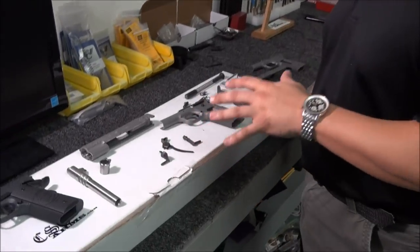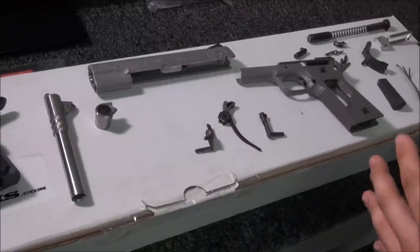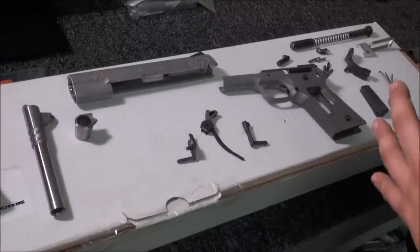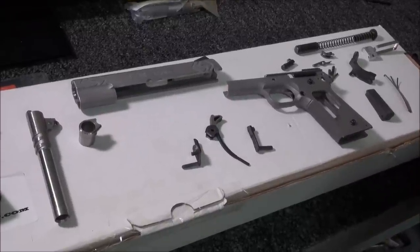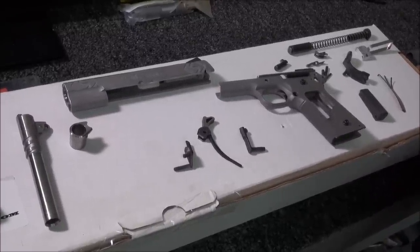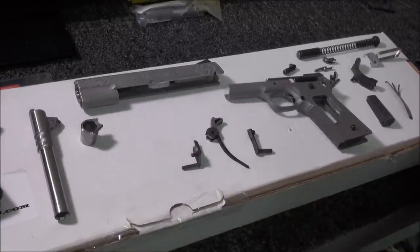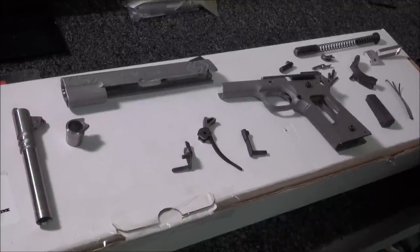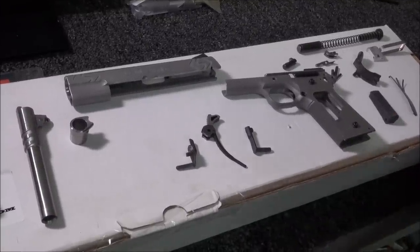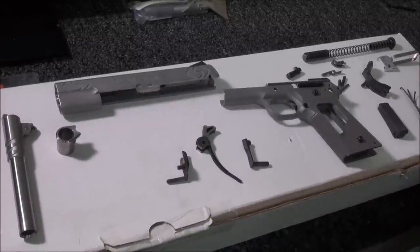There's a lot of man hours doing a custom gun, and a big difference when we talk about a manufactured gun versus a custom gun. With a custom gun and the tolerances, everything has to be hand filed and calibrated — that's what you're going to get in your accuracy. Even down to a match grade barrel, everything is fitted properly. The lugs and the hood of the barrel require tight tolerances to give you your accuracy.